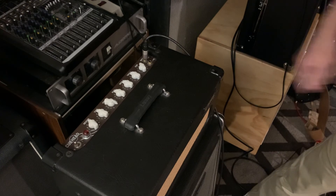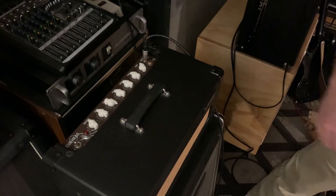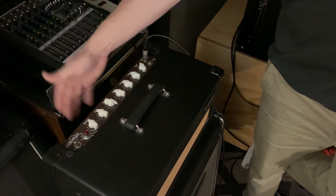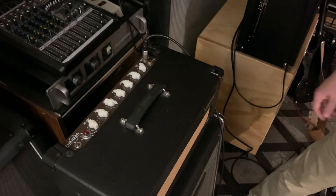At the same time, it won't push your power tubes as hard. So if you're looking for volume, leaving a 12AX7 in valve one is perfectly fine — that's what it was designed to do. The 12AU7 is just an option I wanted you to be aware of.